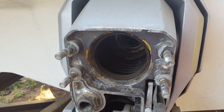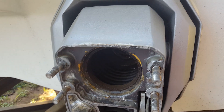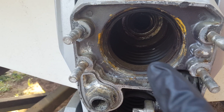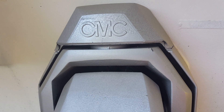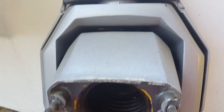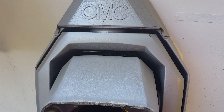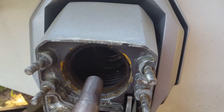The reason we're doing an engine alignment today is because the stern drive was pretty tough to pull off. You can tell if it's the adhesive holding it or if it's the engine coupler. The engine coupler sits behind the gimbal bearing, and if it runs out of alignment it's going to be hard getting your stern drive out.